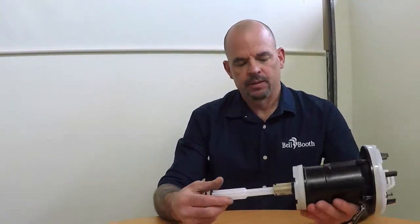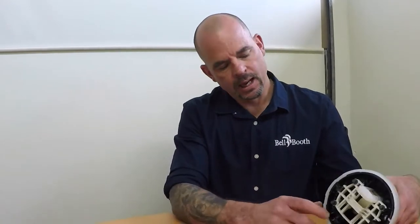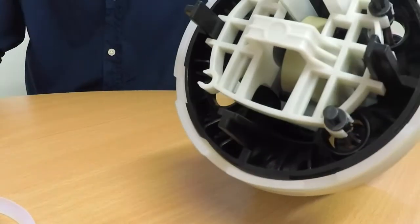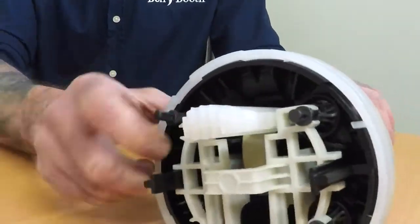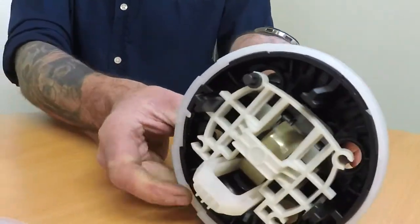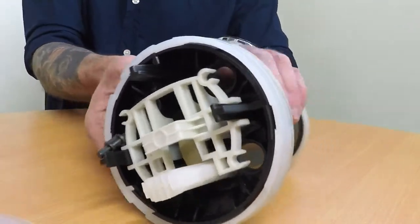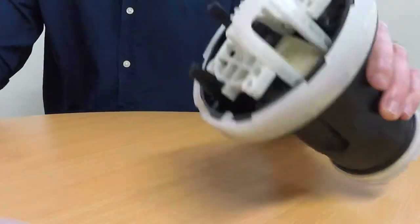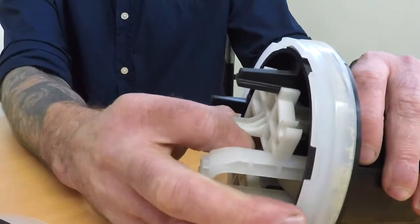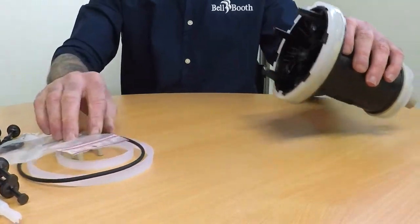First we take our motor — with the plunger rod on the bottom, turn it 90 degrees and remove it. Next, unclip the four top valves by pushing them sideways. Take hold of the bridge at the top, pulling it up, remove the motor assembly and place those to the side.